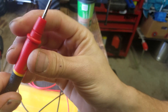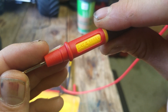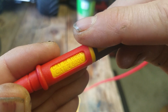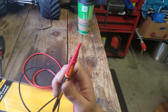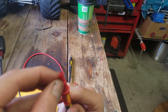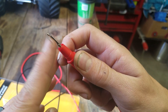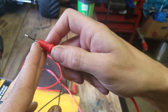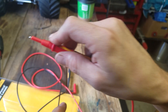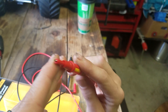The special features about these, as you just saw me demonstrate, is they have different category ratings for this little sleeve that slides up. With the bare tip exposed it's CAT 2, 1000 volts. Then if you twist it, that little sleeve pops up and you get CAT 3, 1000 volts, or CAT 4, 600 volts. Honestly, I never really understood exactly what those numbers meant — it's the voltage rating, the arc rating I guess. This adds a layer of insulation. But the greatest part about this little sleeve — my favorite part — is that sometimes there's too much metal exposed when you're trying to test something in a confined area. You could be going in to test something but something you shouldn't be touching is right next to it. Engage the sleeve, and now you just have the little tip sticking out so you can get in there without shorting something out or making a connection you shouldn't be making. That feature comes in really handy.